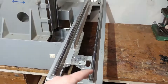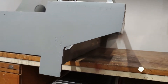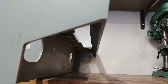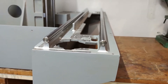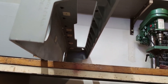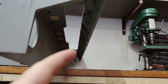The only possible rigidity problem I've seen right away is the cut in the X axis, which does make the outer rail of the X axis a bit unsupported. But if it causes problems with vibrations, I can still attach one or two angular supports from the main body. I can also fill parts of the casting with epoxy granite for even more vibration dampening, as someone also mentioned in the comments in the previous video. But let us first finish the CNC to see how it performs and then make adjustments if necessary.